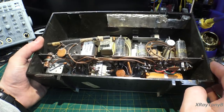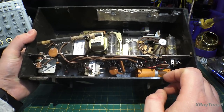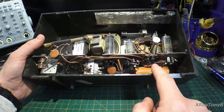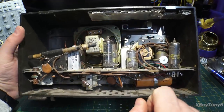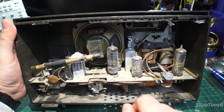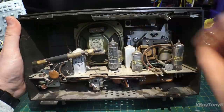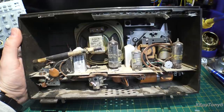The wires from that network come out, and it just saves some space — it's kind of just an early predecessor to an integrated circuit. It's a pretty simple layout with ceramic disc capacitors, so there's really no caps to go bad. I don't see an across-the-line capacitor anywhere other than this ceramic, and I don't even think it's an across-the-line one. So yeah, there's probably not going to be a whole lot wrong with this radio other than needing some cleaning. Hopefully the two IF cans are good and hopefully this little motor here for the clock is good.